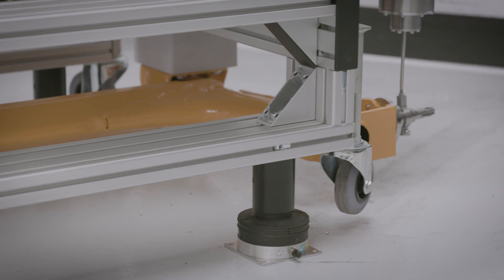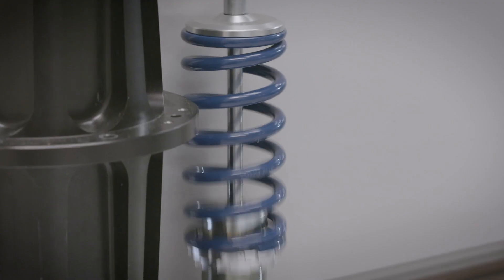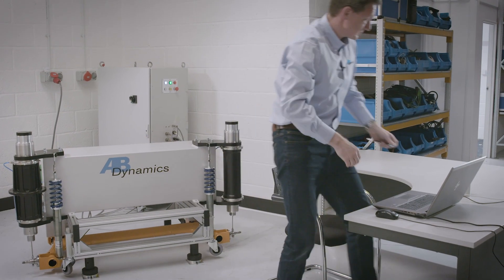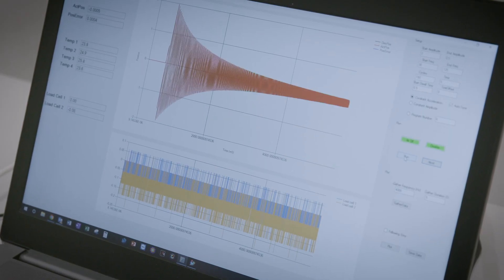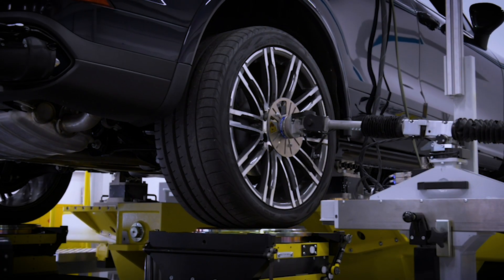Once you've mounted your suspension into the frame, the very high-performance actuators and the auto-tune function make testing exceptionally easy compared to previous systems. AB Dynamics has many years of experience in automotive component testing and data capture, so the software environment gives a very user-friendly and easy system to use. The dynamic arm, which is part of the SPMM 5000E system, can be integrated into the machine so that K and C measurement can be performed at axle level on the ANVH 250 machine.